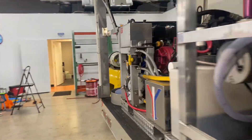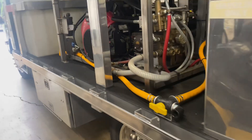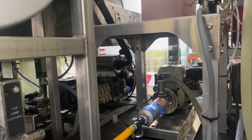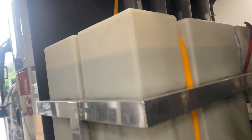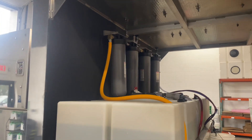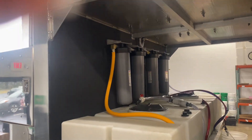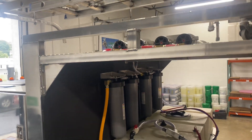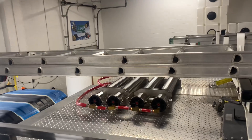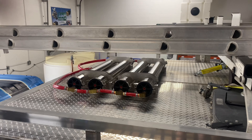I'm going to walk around the other side here. Here's our ball valve for processing — and a better look at that booster pump. And the other side of these filters here. There are four filters there. The first two are your carbon and sediment, and the second two are your DI. And then up top here we have four 40-inch RO filters.